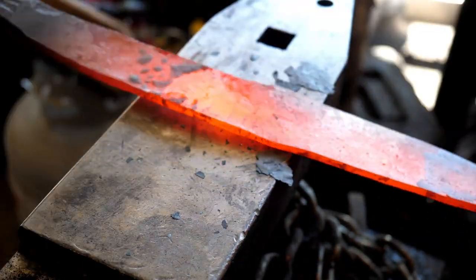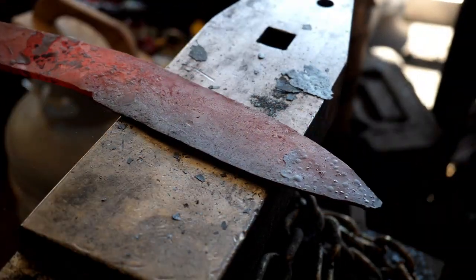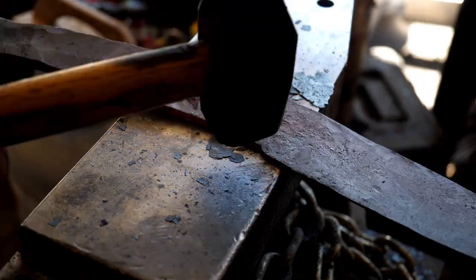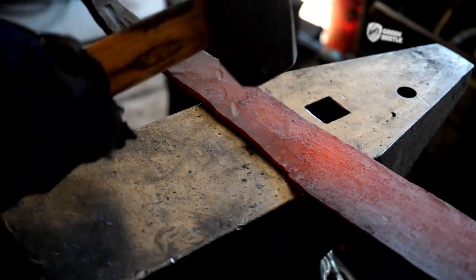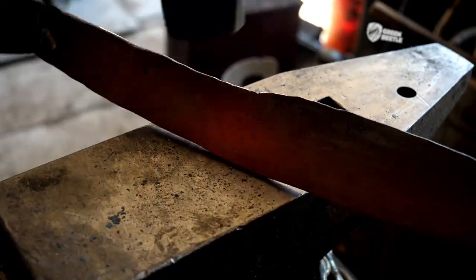Here I'm putting the bend in the back of the blade, but as you can see, it's in the wrong spot — it really should be further down towards the handle. The result is some negative style points for the final shape, in my opinion. We end up biting into the recurve portion of the edge as well, creating this little step-off or notch, which didn't really hammer out like I thought it would.